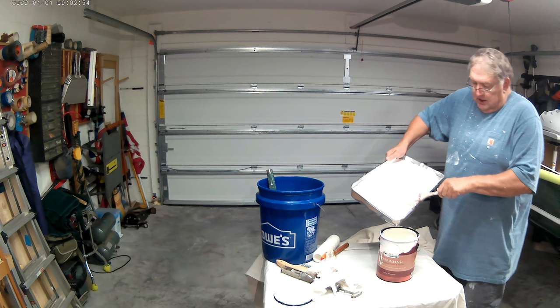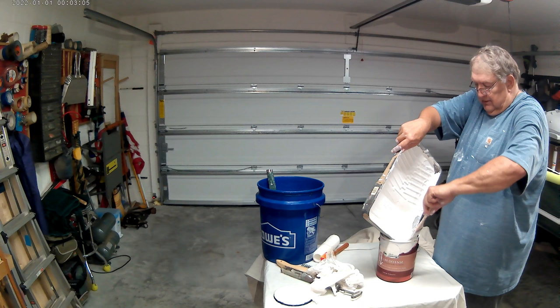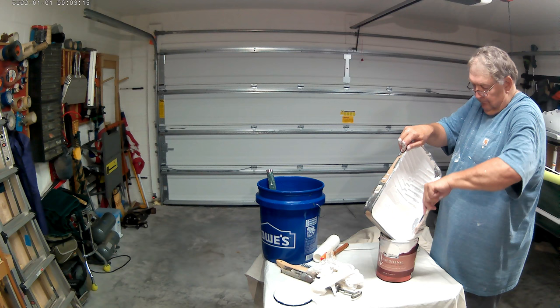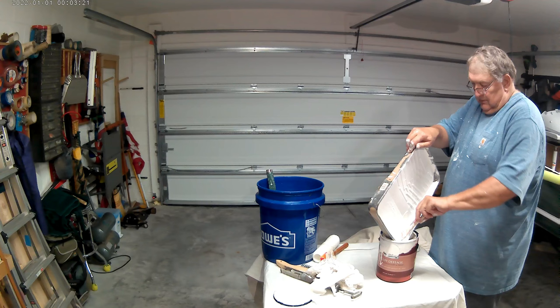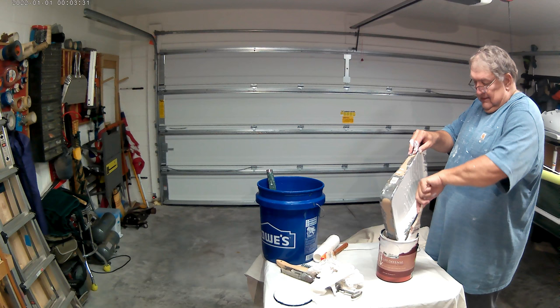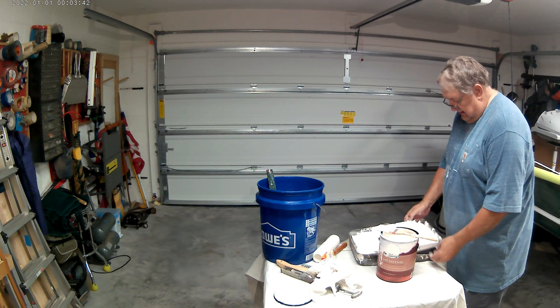Take the tray and your paint brush and tip it up on the corner, working that paint out of your tray. Remember, we put a liner in our tray before we started — that's going to make this a whole lot easier. Wipe that paint out of the liner and get as much as you can into your bucket to save what you didn't use for a touch-up. The good thing about latex is you can go back later and touch it up and it won't be seen, if you use it from the same batch.